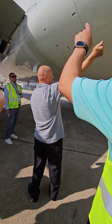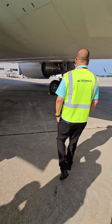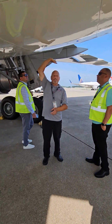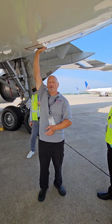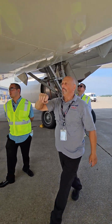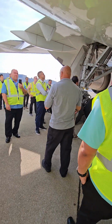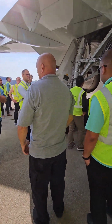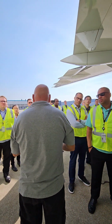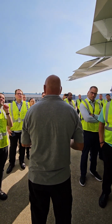Is that what that ram air turbine button is in the flight deck? No, that's this. That one is. Okay. So it comes out automatically if I have dual engine failure, but I can put it out any other time. Okay. But the ADP is a big air-driven hydraulic pump that augments the two little electric pumps on the center system. Okay. So the center system on the 757 just has those two pumps, because there's nothing on the center system except center flight control.